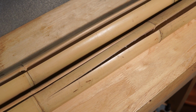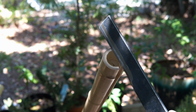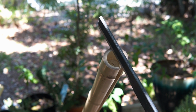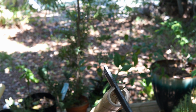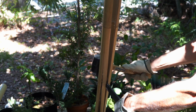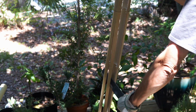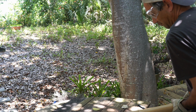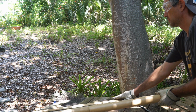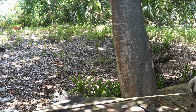Unfortunately, this section has 2 splits, one from each end. I'm electing to continue the split that starts at the butt. There's also a crack that appeared, which I didn't catch until I started the first split. I'm a little lucky with the placement of all these things. While I need to apply a little forethought and skill to my splitting, they won't affect me too much. After making my halving split, I pull apart the other pre-existing split. It isn't quite 1/3 of that half, so I'll have some unevenness on this one.